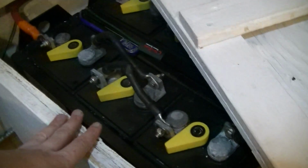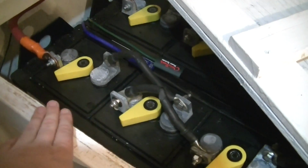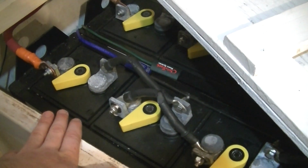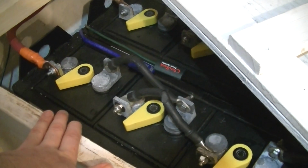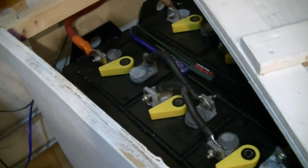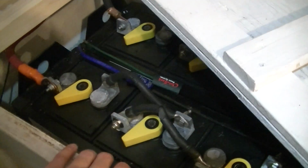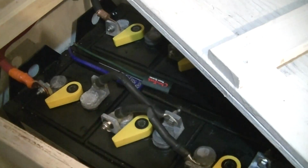for this type of battery, although a lot of people don't, especially not starting out with these, and even for their final system, they don't tend to like to use these because they're big and expensive, although granted, if you get decent quality golf cart batteries, they're not going to last as long, and cost-wise for the amount of capacity they're fairly comparable over the life of the battery. Whereas these things, properly treated, are good for well north of 15 years, so that's why we got them.